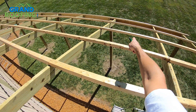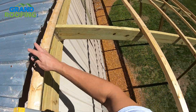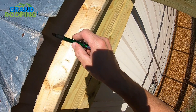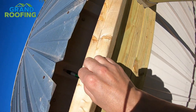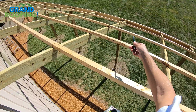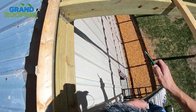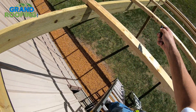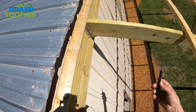We're going to hook on down at the bottom and come up — we'll do our transition first. Essentially, we want to make sure our tape measure is measuring from right in here at this rib. You want to make sure the flashing goes under there but isn't smashing it. You want to be at the very bottom where your apron corner is going to be, and you're going to add 1 inch — you want it to hang down past your apron, but not smashing it.